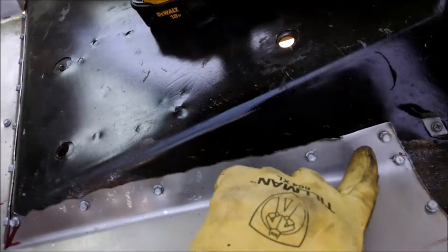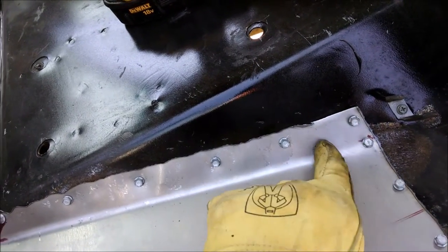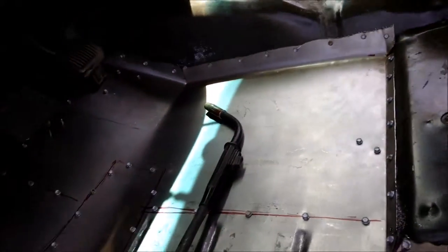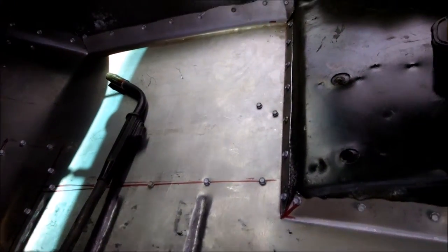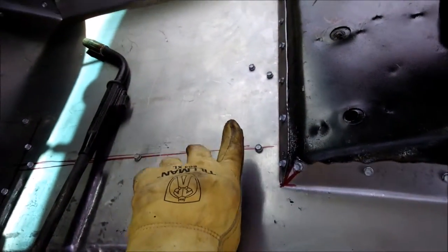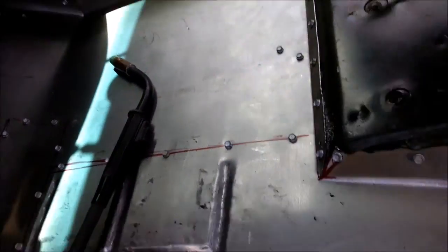I'm getting ready to pull one screw out and spot weld it. You don't do it in a row like this, you could warp it. So you do one here and one clear over here and one clear over here, and here, here, there, all over, and just keep randomly picking a spot. That way it stays good and flat and doesn't warp everything. What I'll do is weld the trusses first. Any place that has support trusses underneath, we'll do them first before we do the outside perimeter.